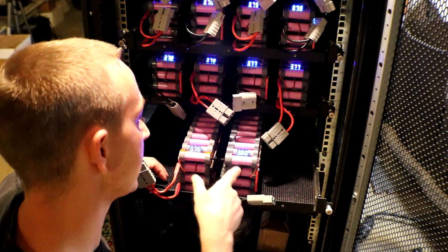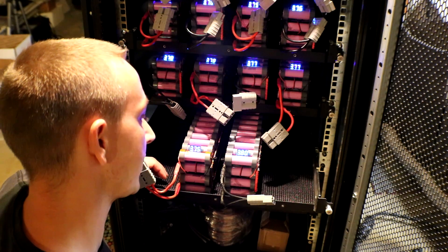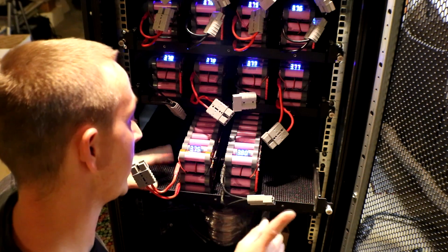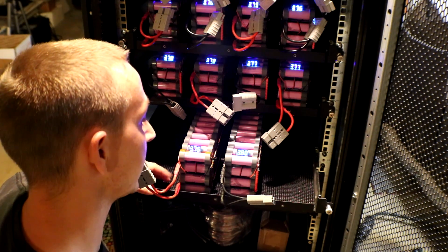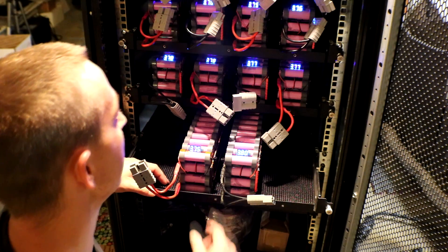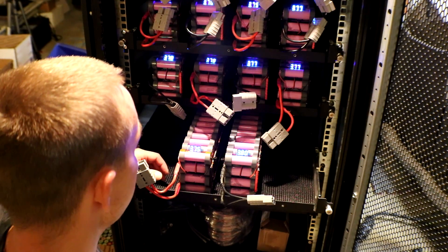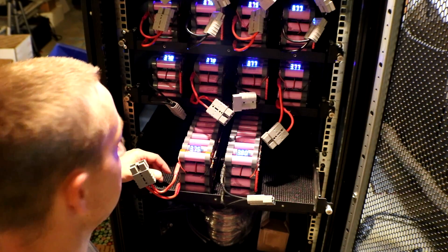This is that low pack that I had. It had a couple of broken fuses and a couple of solder joints that were not even connected at all. I did charge it up with just one TP4056 to bring it up high enough so I could reconnect the fuses. Other than that, they're all sitting around 3.78 volts roughly, so I'll hook it back up for now and probably rebalance it on the top end.